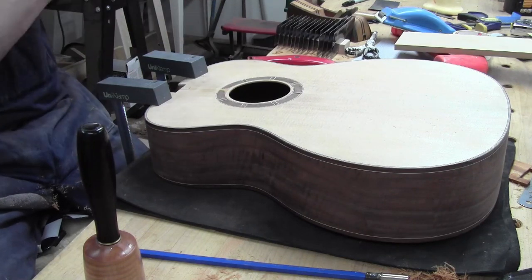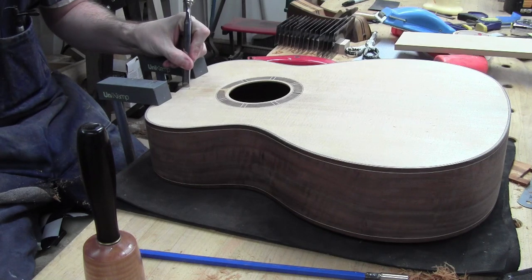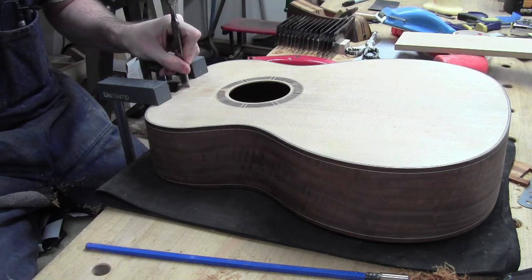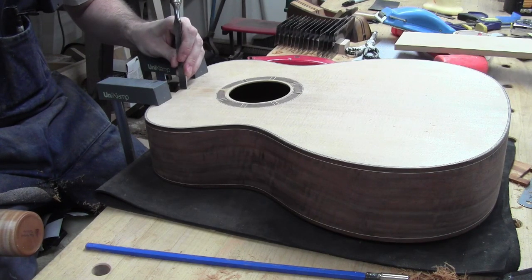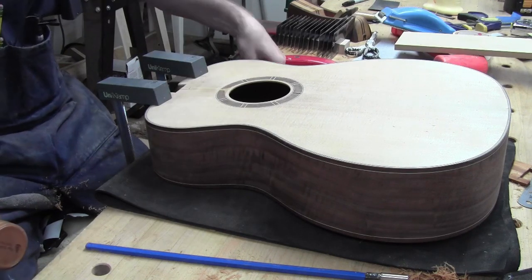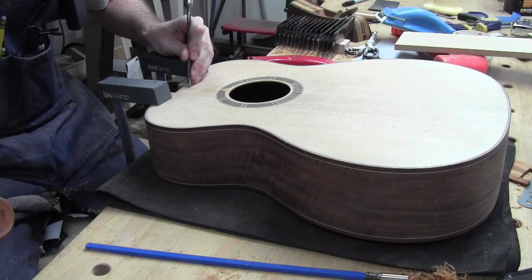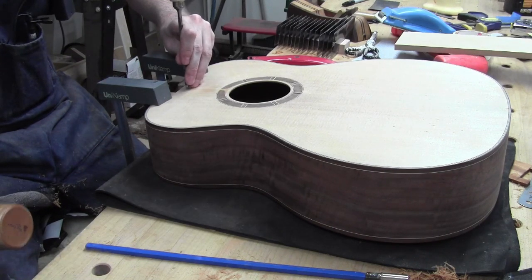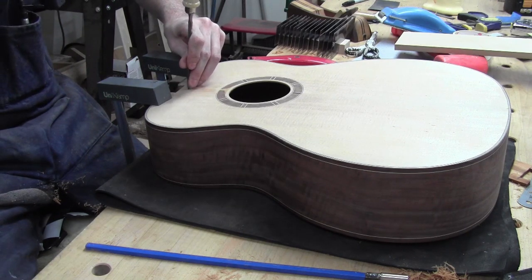Got a couple of chisels, and the first thing I want to do is mark out, or score the fibers a bit, where I want to cut. So very gently, just take a tiny bit, just to tap. We'll take our smaller chisel here. We'll extend that one a bit, I guess. And then we'll do our end here.